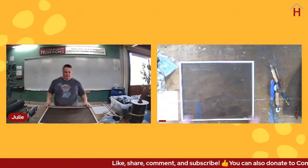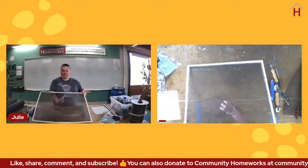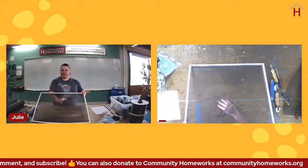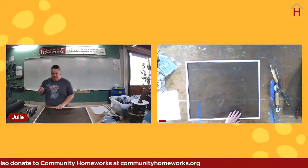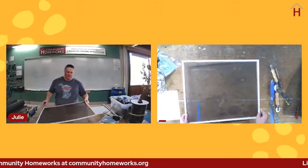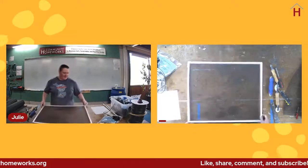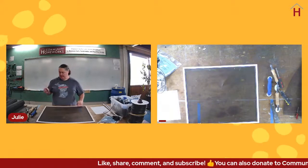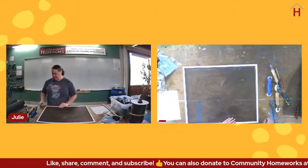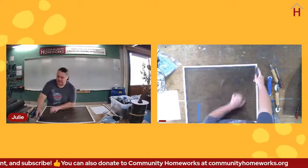All right, so now let's start working on this one here, which has this big rip in it. We can't possibly patch that guy. Again, we're going to start with whatever tool you have handy that's going to let you dig that spline out. Or if you don't have something like that to dig the spline out of that channel, another way you can do it is just your utility knife.